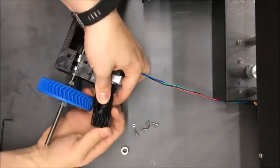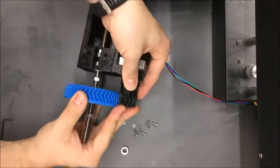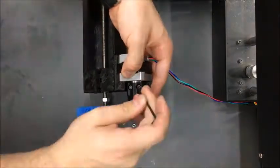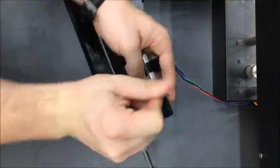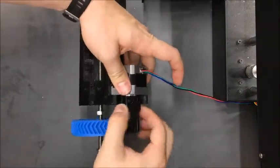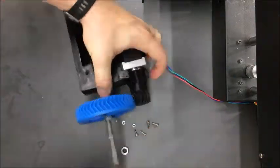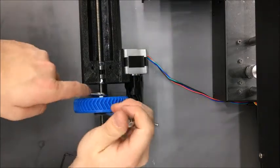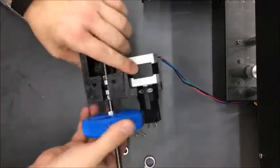Put the small gear on — you may need to back up a little to do that. Once they're matched and assembled correctly, tighten down the small gear pretty tight. As the small gear spins, it also spins the motor shaft and engages well with the big gear. Back up the large gear's nuts and tighten them down, counter-tightening one on each side and spinning them equivalent amounts so you don't shift the big gear's rotational position.